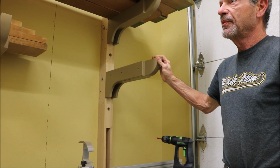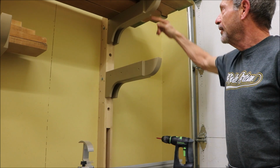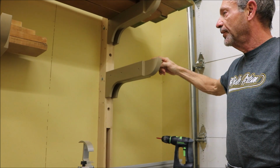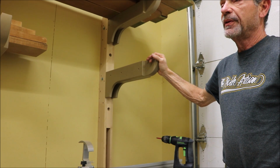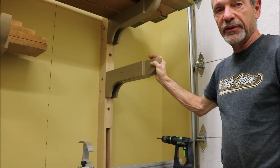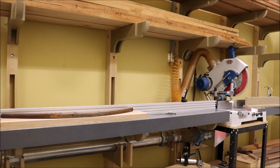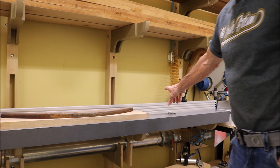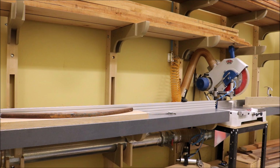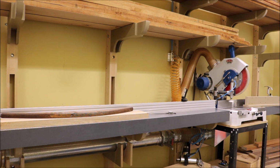So, as I think I mentioned, I think I said it was 20 inches, it's actually 12 from here to here, with one of the bays full. It's about a little north of 300 board feet of lumber, so it's a pretty efficient system. Support arms also serve an additional function in that this level of support arms allowed me to build in-feed and out-feed tables from a chop saw. They're plenty sturdy, and then there is dust collection piping running underneath in brackets, again tied to the stanchions.